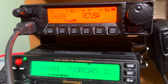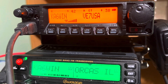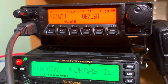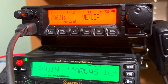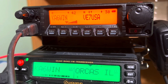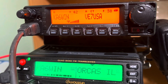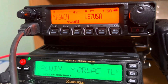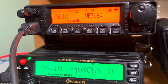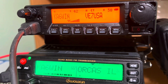In some cases that can be decoded. The node or repeater will send that back out and generate it on its end, and you can receive it on your radio. Unless you're receiving some interference or static or intermod, I tend not to use that feature. I am using it tonight because I'm at a repeater site where there's lots of transmitters and lots of RF, and my radio is getting overloaded in the front end, so I am using tone squelch tonight, but I usually don't.